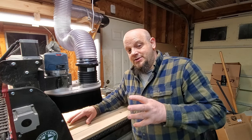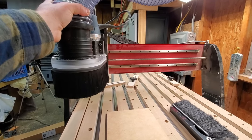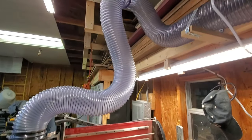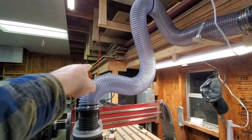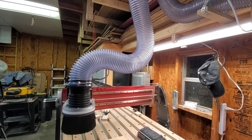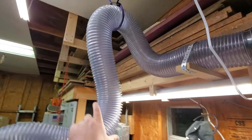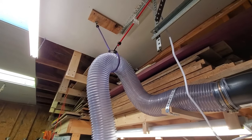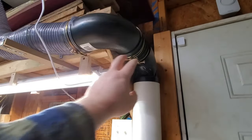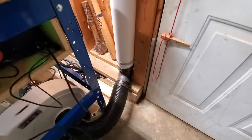Let me show you the other part of the system. I've got the quick-release adapter to quickly take the boot off to clean the table. For dust collection routing, I've got it mounted from the ceiling, coming over and down. I was going to build a dedicated arm with PVC and may still do that, but for now I've got it up here attached with springy bungee cords for a little bit of spring back, then coming across with two elbows into PVC going down.